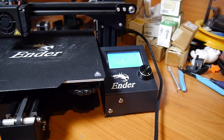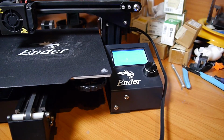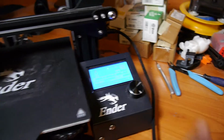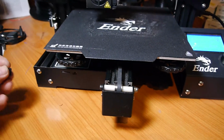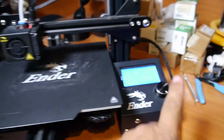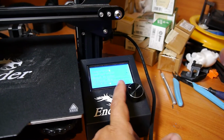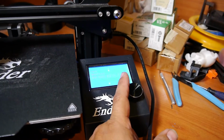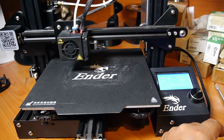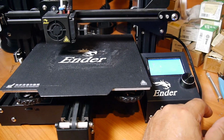So I'm not going to preheat anything this time. It seems like it's when it's trying to preheat. But there is one thing I do want to try. I'm going to put this card back in. Initialize media, print from media. Let's do this test and see if it gives that weird noise again. Oh, it's quieter. Okay, so that jumper definitely helped.